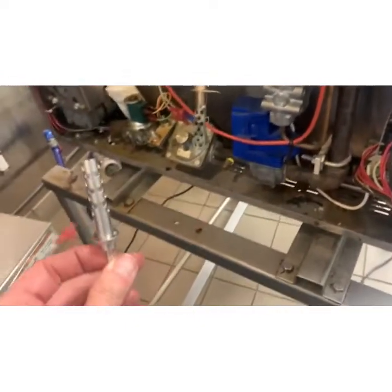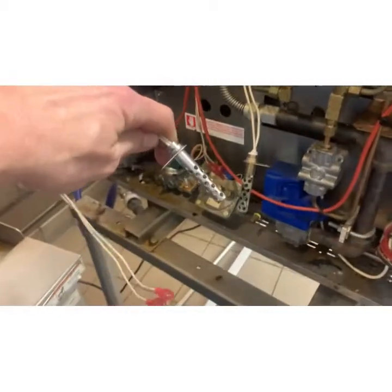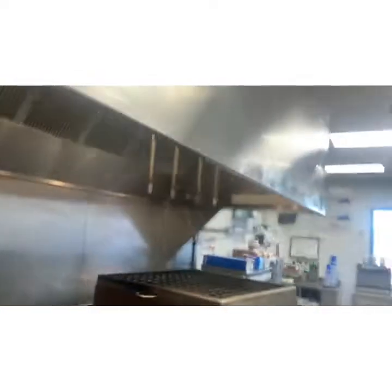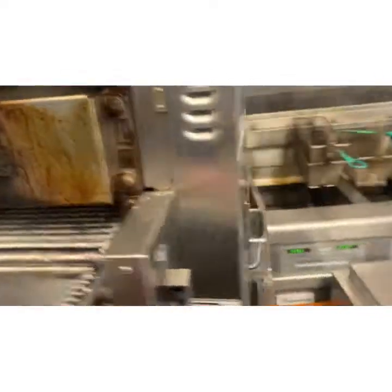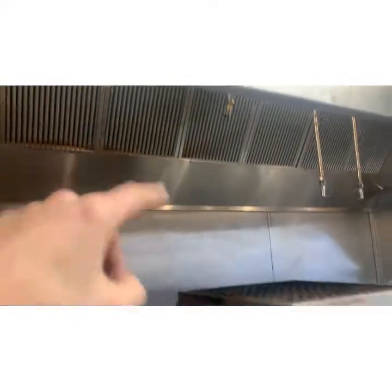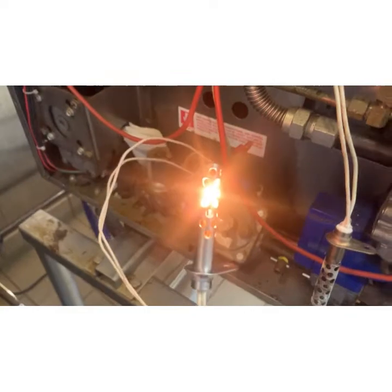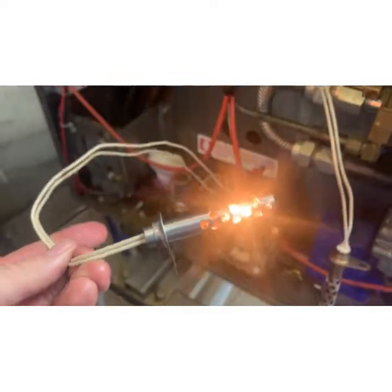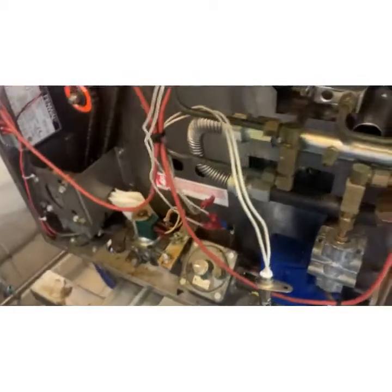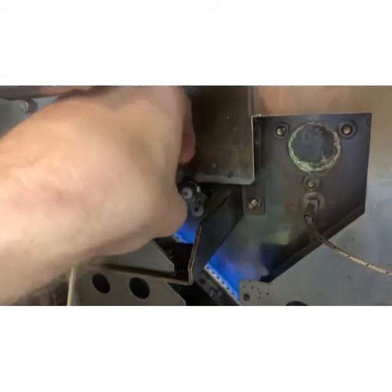Let me swap these — this is quick and simple. Obviously, we keep these on stock on hand. It's a two-plate terminal, quick and easy. I'm not going to mount it — I'm going to hang it and show you the difference. I also want to note: I should be doing this more under the hood. I'm a little forward because when I turn this on it's just the pilot gas, but the gas does come on, so at least I want the hood pulling it out. I don't want gas to build up. All right, let's turn this on now and look at this new one. Look at that — see, that's how they're supposed to light up. The other one just isn't strong enough. I'm going to stick this in here. Boom — lit right up.